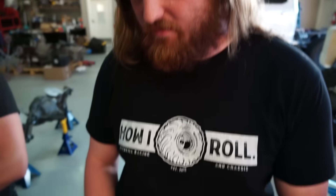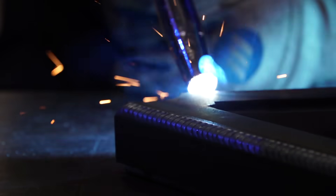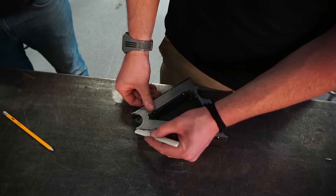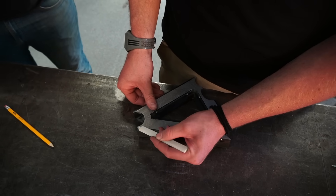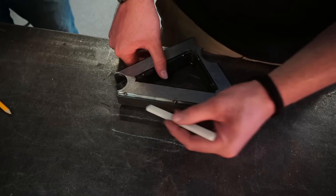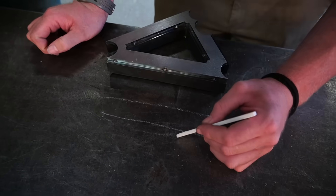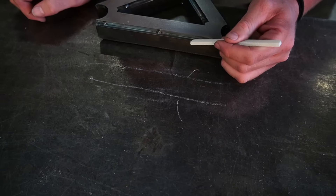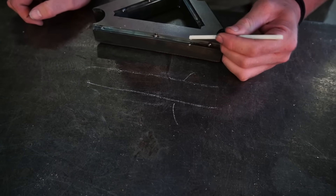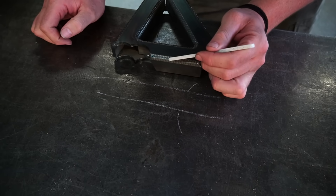So what I'm going to do here is actually show a visual demonstration of basically what Rod is talking about. We're going to use this piece that Rod welded on the backside — a quarter inch open corner like he was talking about — and describe what he was saying but actually on the table itself. So if we depict these lines as being the throat of the weld — basically the inside section — and these two lines here being the toes, which are these edges, these are really what you want to focus on if you want to have that nice consistent looking weld.